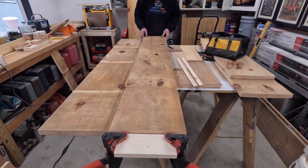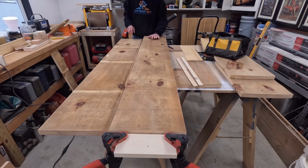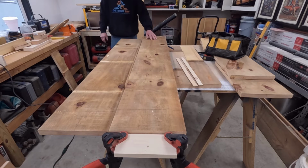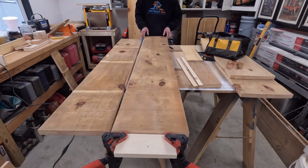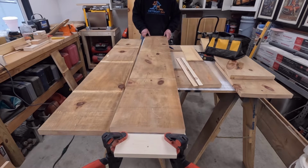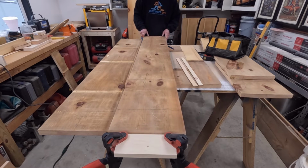So at this point in time, what I want to do, just to kind of hold this on the workpiece, I'm happy with it. I am not going to try to shim these corners. I believe that I'll still wind up with an extremely flat piece of material here. I am going to use a little hot glue and glue this to my melamine sled so that it doesn't move around at all. I want it attached.